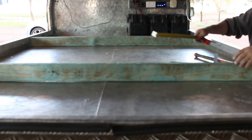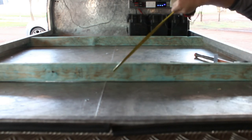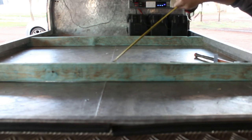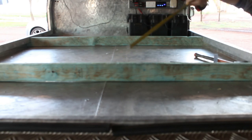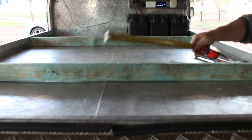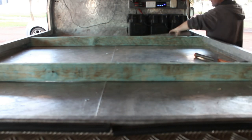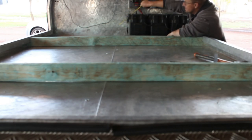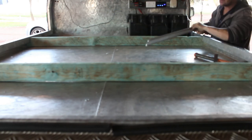I am going to be cutting the centre out the thickness of the timber. Only 45 down because it's 90 mil from top to bottom. So I'll be cutting a 45 mil from top to bottom by 35 this way, through the one-two pieces and probably the one that goes at the back here. I've got another one that's got to go here, another timber there, and we'll come around the batteries. And like I said, continue on with the other one there. So the centre piece will tie everything in.